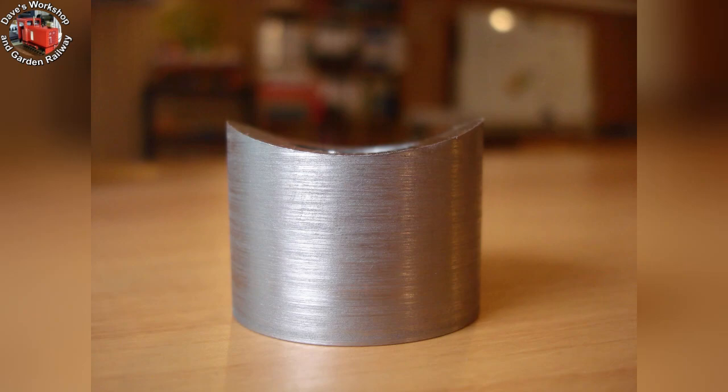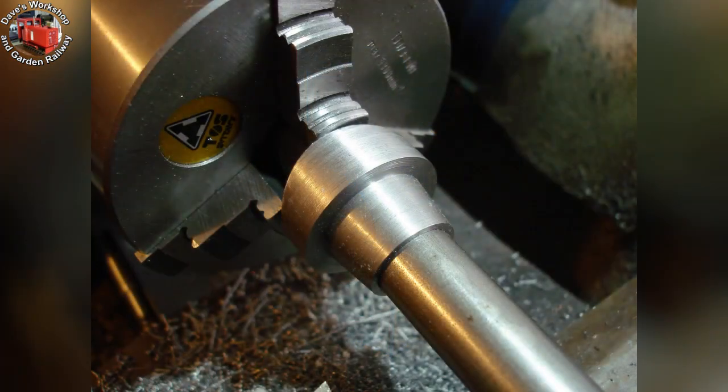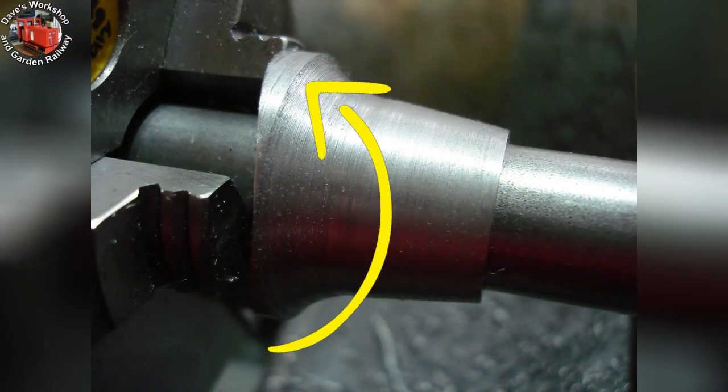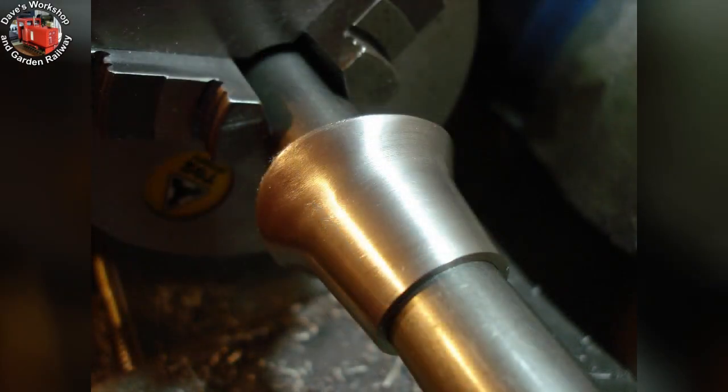The radius wasn't quite as good a match on the smokebox as I would have liked, but never mind. In place, ready for more shaping. Superglued to a three-quarters inch bar for mandrel turning. The top taper has been turned. Superglue is perfectly adequate for this work, and requires a lot less heat to remove afterwards than my Loctite. A big radius generated step-by-step. That big land needs filing down. After filing and some polishing — the whole surface needed filing, just about.